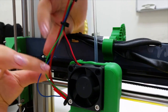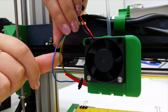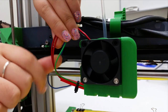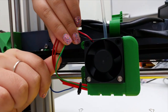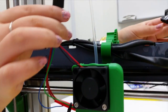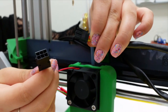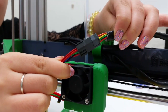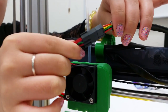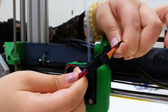The two wires in green and blue are connected to your thermistor. The remaining two wires — in my case both are red — are connected to the heater. When connecting these two connectors, the color should be matched with each other. The orientation of the connector does not matter as long as the color codes are matched.